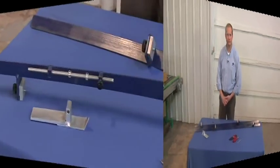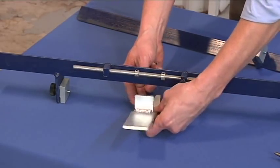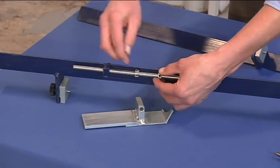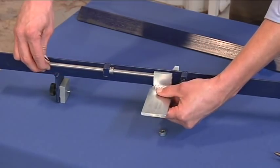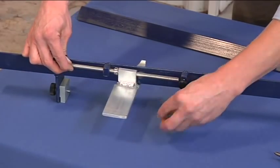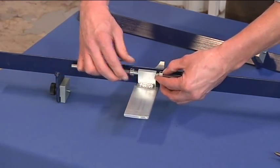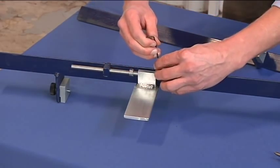Once you've uncrated and unboxed all the parts of your new transplanter, three tools will be needed: a 7/16 wrench, a Phillips screwdriver, and an Allen wrench set. The first step of setup is assembling the flat stop block. Using a 3/32 Allen wrench, remove the collars from the rod, sliding the slot along it. Then placing the flat stop somewhere in the middle, and we'll adjust these later.